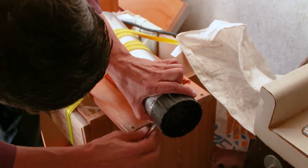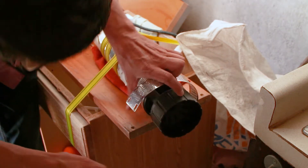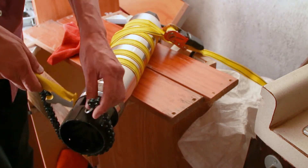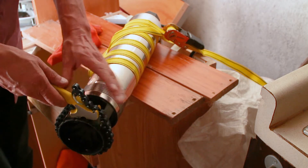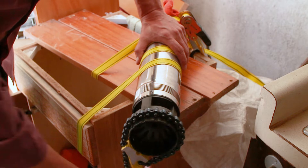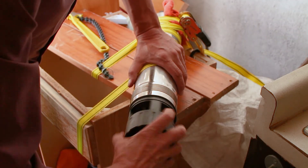Remove the stainless steel filter plate — this one is held in with two cross head screws. The plastic base can be removed using a chain wrench, but some pumps require far more leverage. Now unscrew and remove the plastic base cap.